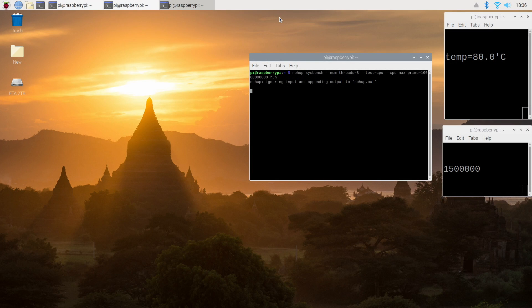Before we get into the results, I just want to give you a quick overview of my testing method. First thing I did was grab the idle temps — I booted the Raspberry Pi up, let it sit for five minutes, and captured the idle temps. Then I opened up Chromium, ran a 720p video for five minutes, did some web browsing, and tested thermals on both of those. I also extracted a Raspbian image — it's 1.1 gigabytes. And finally, my extreme test: I used Sysbench to totally max out all the CPU cores. Within four minutes without a heatsink, we're already thermal throttling at 81 degrees Celsius. So I've recorded all of my thermals without a heatsink, and I'm going to put them inside of a chart along with all of the other ones you're about to see.